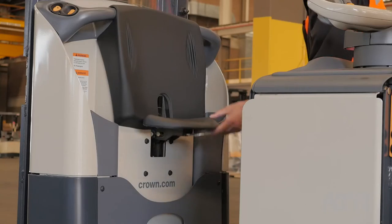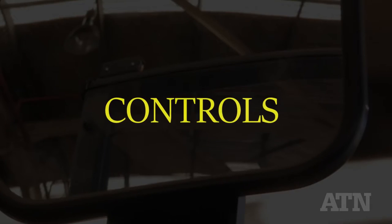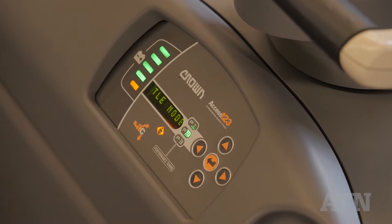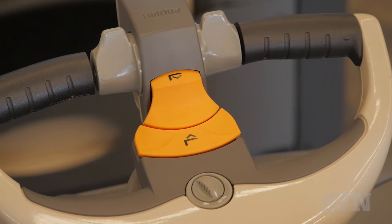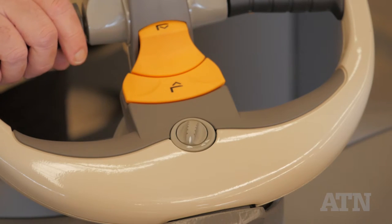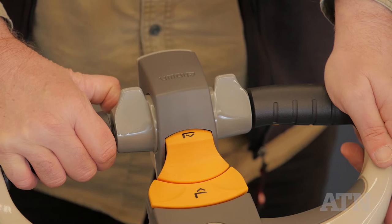There's plenty of space for a fold-out and height-adjustable seat. A compact dashboard has a battery charge indicator and keypad start-up once a four-digit code has been entered. Two maximum travel speeds are available for either novice or experienced operators, and these are set by a little switch ahead of the main forklift lower switches. These incidentally are yellow to distinguish them from the grey direction switches.